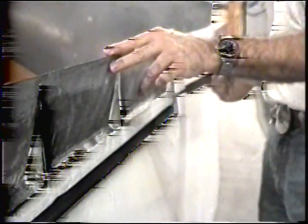The decision as to where we're going to put in the holes, we may end up with one at the trailing edge, bottom and inboard. My concern is that the holes that we put in are also the holes that can provide access for water to enter. We want the aileron to breathe, but we don't want it to collect water. The definitive on that a little later.